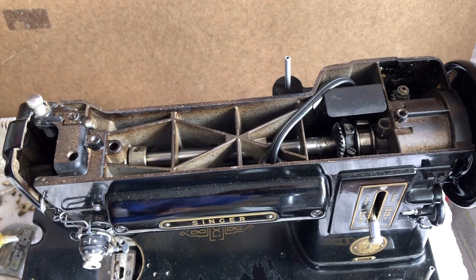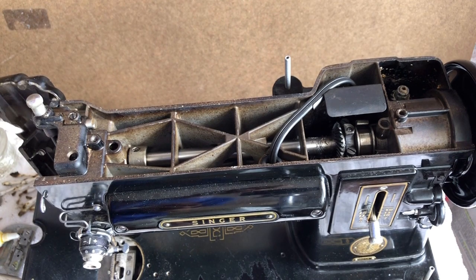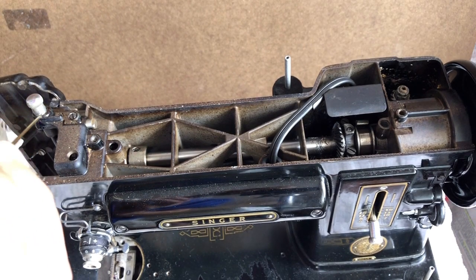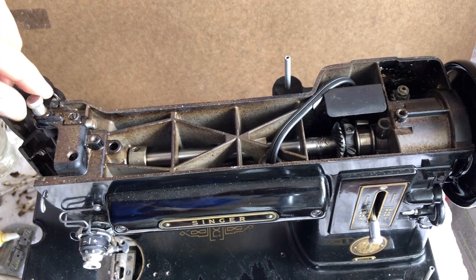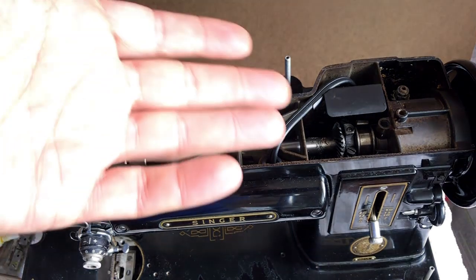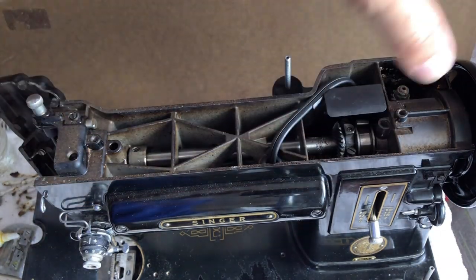For the purpose of restoration, we often find we need more than that. Over at the presser bar, I'm going to open that door and clean some of the old dust or soiling. I'm going to put a couple of drops around the threads of the presser bar adjuster. One drop is usually enough, and this isn't really a normal oiling point even, but I am dealing with what is essentially a pretty dry machine. There you go — you've just seen me overhaul the cleaning, the grease, and the lubrication for the upper part of this machine.